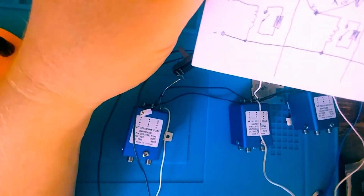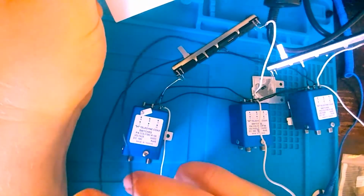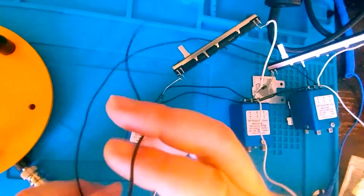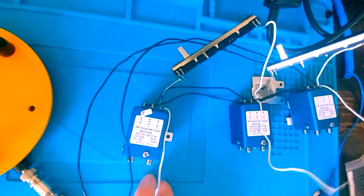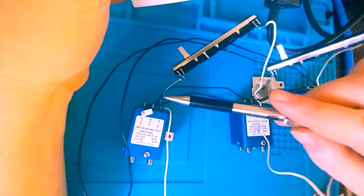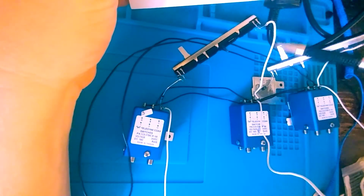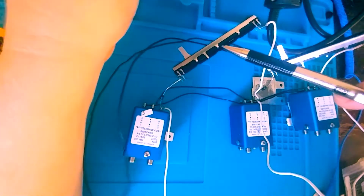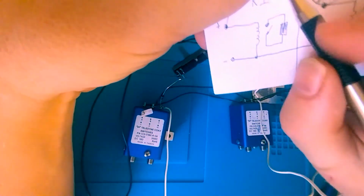and actuate. So what I did was I mocked up the two bad relays that I had with the one good relay, no different than what it would be in a wiring harness. Here goes. Post one and post two, the commons for all three relays are completely separate, minus the fact that I included a 1N4007 diode from the common on K3, again, ignore the sticker, going to a sliding potentiometer that I pulled from an amplifier. This sliding potentiometer I set for 320 ohms.